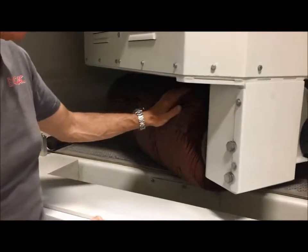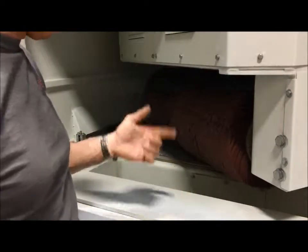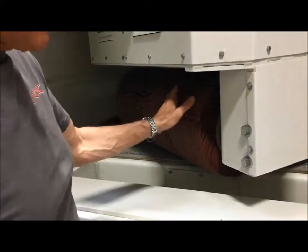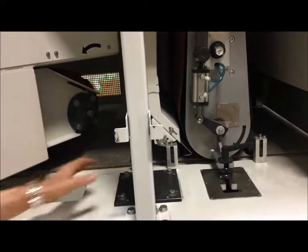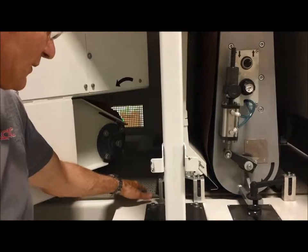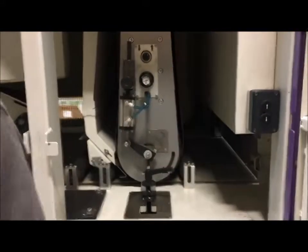And these have a tendency to actually wanting to pick up a part and then subsequently of course throwing it. So it's not so much an issue of the part slipping, but it's more an issue of it being picked up and actually being tossed, and your parts would be too small for that to reliably run on this vacuum conveyor belt, which has a lot of holes. And this is also a much more expensive consumable. This is always in the conveyor belt, as a cross belt machine is, and I'll talk about that in a minute. But this is a more expensive conveyor simply because it has all these perforations in them, which cost money to put in. So I don't think that that is a good solution for you in this case.